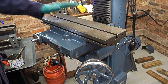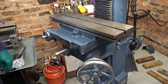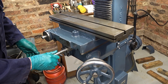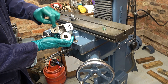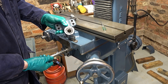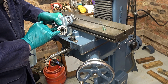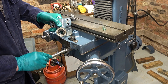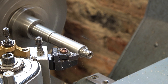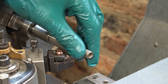I'll fully adjust the gib on this table once I've got the handle on here, but first I need to put this assembly back on and the hand wheel. Note the two tapered locating pins. I've found there's a seal here just like an oil seal, but there's no lead on the front of this shaft, so I'm going to put a lead on it because I'm sure it could damage this — I will put a small lead on that.